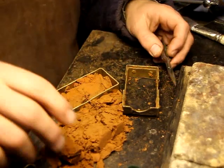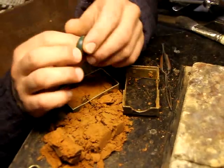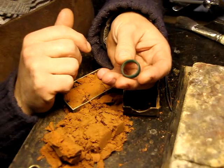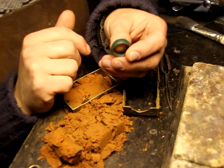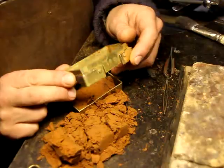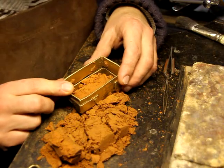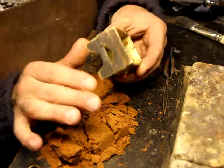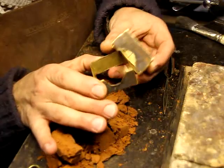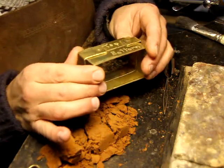Today I'm going to cast a ring in silver using this Delft clay. This is the ring we're going to be casting — it's quite a simple shape, just carved in wax. This Delft clay system you can buy from the majority of suppliers. It originally comes in two round forms, though I've made these simple rectangular forms which I think enable me to cast a lot more different forms.